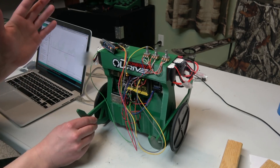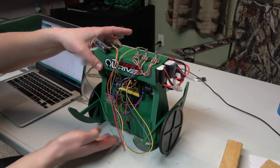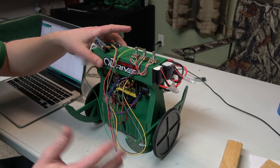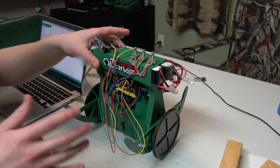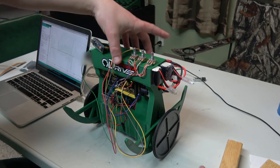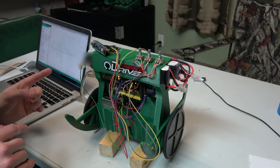It's really close but it's starting to oscillate itself to pieces, which is the problem. I think the issue might be that the ODrive tunings are a bit soft right now — I actually turned them down when I was troubleshooting some other stuff hoping to eliminate some electrical noise. So I'm going to turn the ODrive tunings back up and see if that dampens the oscillations.